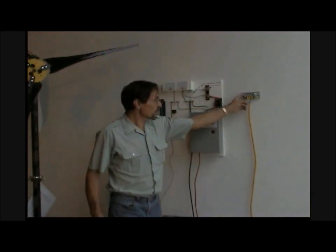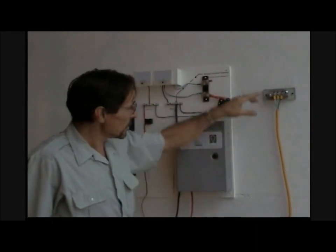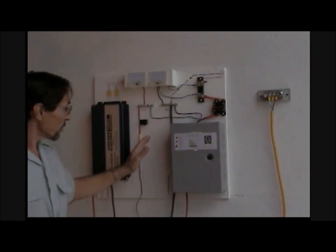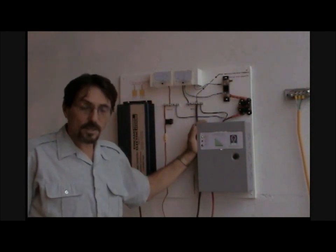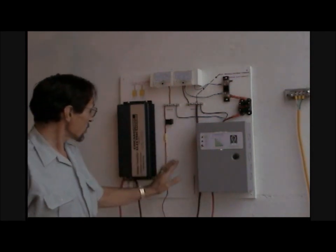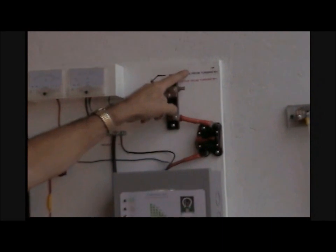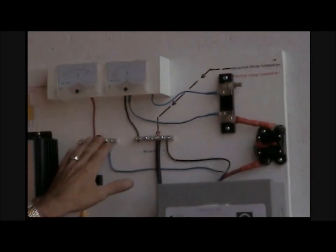Now you've got your three-phase AC block mounted on the wall, and all you have to do is attach a cable — positive to this side, negative to that side. These will come over to the charge controller board. All wind turbines and solar panels need some way to charge the battery, or to keep the battery charged at a specific voltage that doesn't overcharge or undercharge. You bring your positive in from the turbine and connect it here, and then your negative just goes to a bus bar. I've set up a couple bus bars here — one for positive, one for negative.